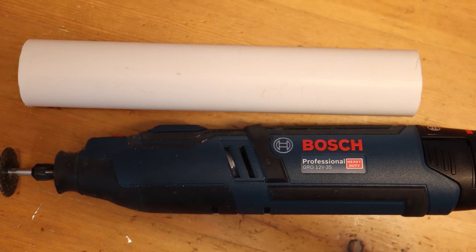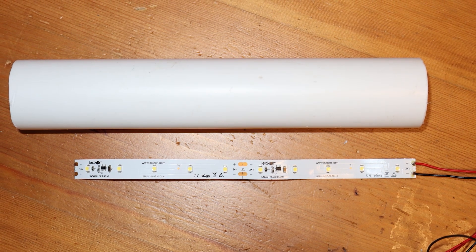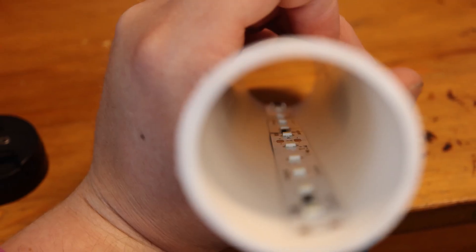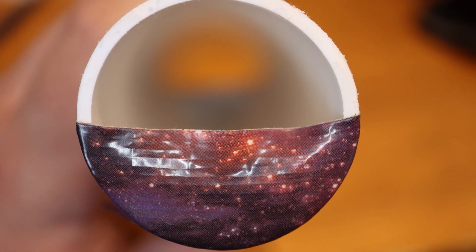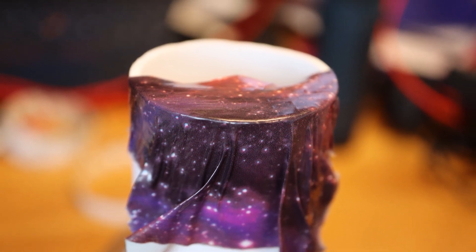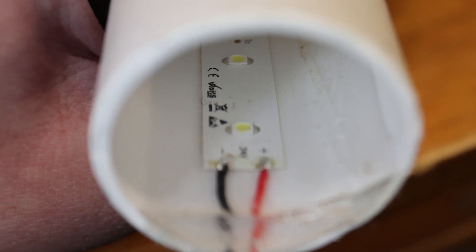I'm going to have a go at sticking the LEDs in the pipe, checking if that works, then have a go at encapsulating the sensor in resin to make it watertight. Starting with the pipe hardware: I've cut a length of pipe using a rotary tool. I've trimmed down a piece of white LED strip light to fit inside that tube and glued it down. I've put some tape at the end of the pipe halfway up to seal it, because I'm going to pour clear epoxy over the LED strip to waterproof it — and that's secured all my LED strips.